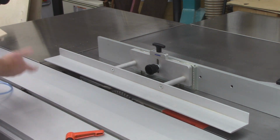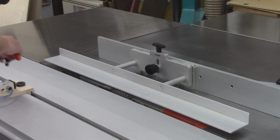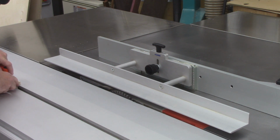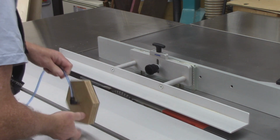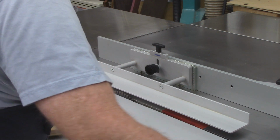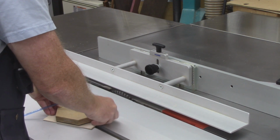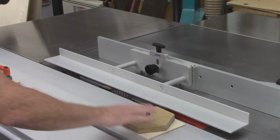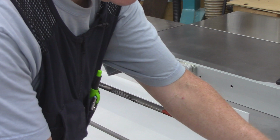Now, if this piece of equipment looks familiar, it's because I used it in a previous video on vacuum clamping for the shaper. Let's see if I can do this. Blue hose up here to this push to connect, and this does swivel around. I've got roughly 22 inches of mercury vacuum. First, let's try the MDF.